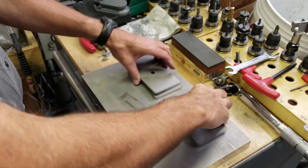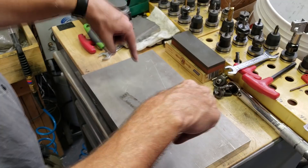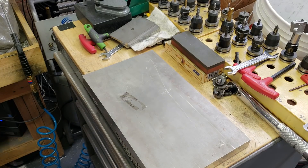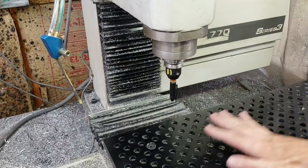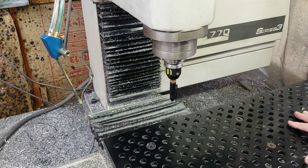The first thing I need to do is the bottom part — the holes, the counterbores, and the locating pins to fit on the Saunders Machine Works tooling plate. I'm going to start off by re-marking my work envelope. I really don't want to make a permanent mark on here, because I don't know if I'm going to change tooling plates or if I move the tooling plate on the mill.